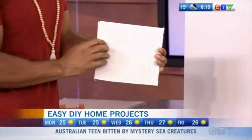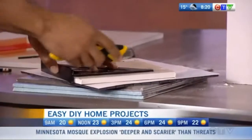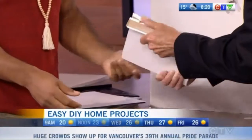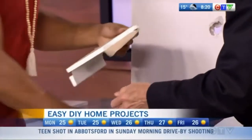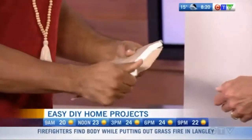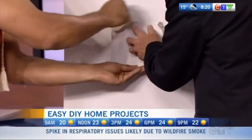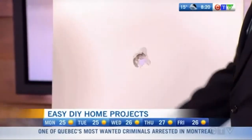What you're going to want to do is get a piece of drywall and cut a little square that's bigger than your hole. Turn it around onto its back and score the sides about an inch in — scoring those edges. Then you crack it and peel off the paper, creating the butterfly wings. Once you've done that, stick it on, trace around that shape, cut your hole out, throw your mud on there — no tape — and stick it on. And there you have it: the butterfly drywall patch.